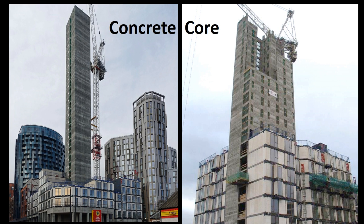For taller buildings we tend to use slip-form concrete cores. The modules are in manufacture at the same time as the core is under construction, and once the modules start arriving the erection time is relatively quick. The mix of concrete core with steel modules introduces construction difficulties where we must deal with elastic shortening, creep and shrinkage of the concrete. The vertical support of the steel work needs to be independent from the concrete core, as long-term creep and shrinkage reduce the height of the core over time and rigid connections may impose large loads on the steel work. With modular solutions, the steel columns in the module are erected as close as practically possible to the core — maybe within 50 or 60mm of the concrete.